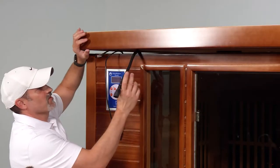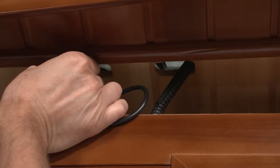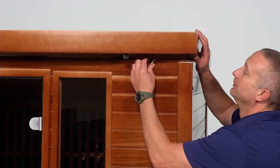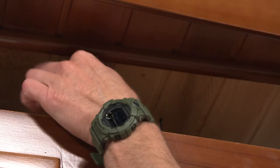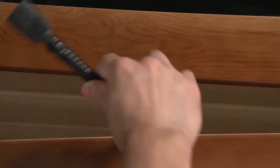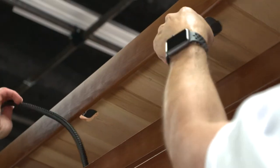On the left-hand side of the front wall, above the control panel, are three cables. Run the black 120-volt heater plug through the hole on the right. Feed the black quarter-inch coax FM antenna and the beige CAT5 cable through the remaining hole. On the right-hand side of the front wall are two plugs. The pin jack coming from the roof cap is the power cord for the ionizer — place this plug on the inside of the sauna to be connected later. Then run the black 120-volt heater plug through the pre-drilled hole in the front of the roof cap. Do the same with the four remaining black 120-volt heater plugs located on each side wall and two on the back wall.